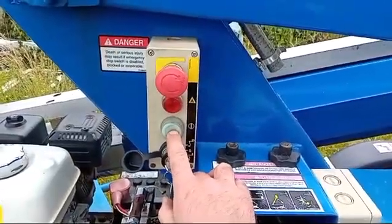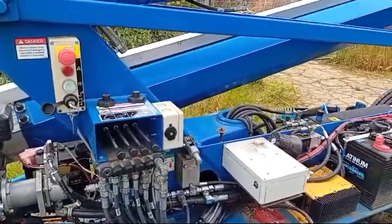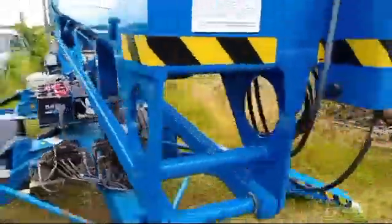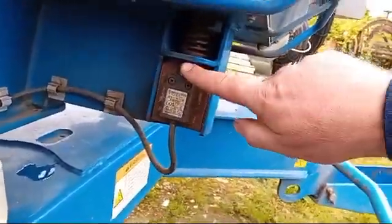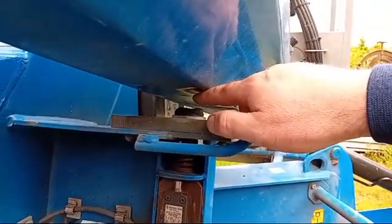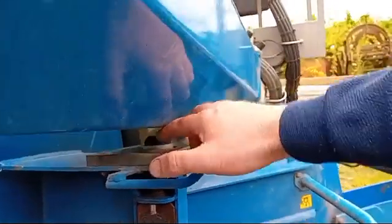If you press the green power button and the pump runs, we at least know we've got power and everything's fine. I've left the boom raised here, and that's your clue — the legs won't operate when the boom is in any position but fully down, and I really do mean fully down. Underneath the boom is a switch. The boom has to come fully down, squash this down against the spring, and release this switch. This switch tells the control box that the boom isn't up in the air. So whether the boom is up an inch or 60 feet off the floor at maximum height, it says you're not fully down and therefore the legs won't work — it's a safety feature.